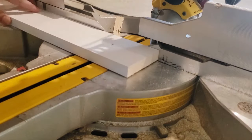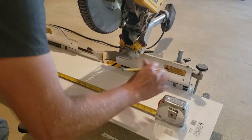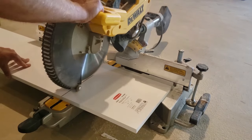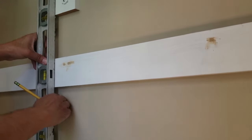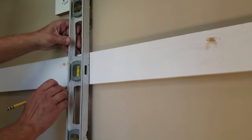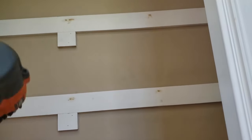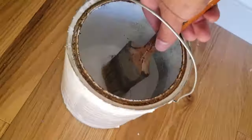Now I'm going to cut some three-inch scrap boards for the hangers and cut the shelf board — I'll mark it out at five feet, score the top of the board, and then cut it. I'll mark out where I need to place the scrap board for the hangers, use the nail gun to tack it in place, and also make the other boards a little more secure. Then I'll sand off the putty and put one more coat of white paint on the board.